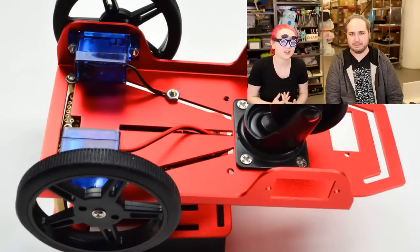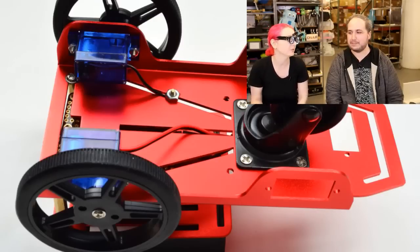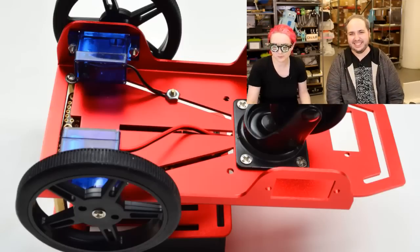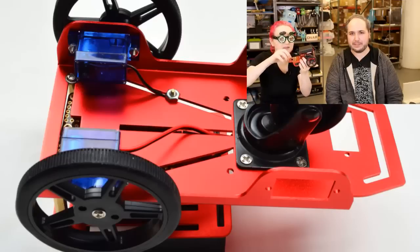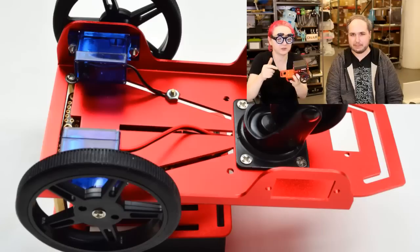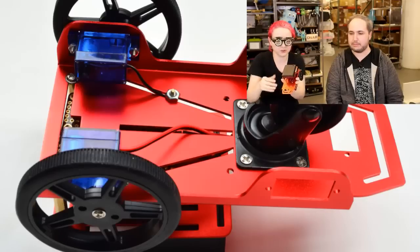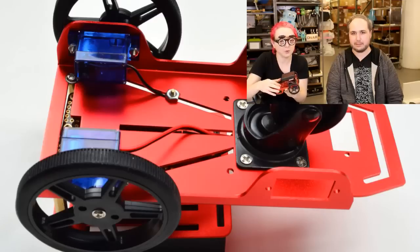There are so many chassis made out of plastic or acrylic, and the first thing that's going to happen is it falls off a table and cracks in half — acrylic is brittle. So this is a nice aluminum chassis so you can drill into it or cut it if you need to. It's soft enough that a small hacksaw can do it. What I like about this one is you can build it as a two or four wheel robot.